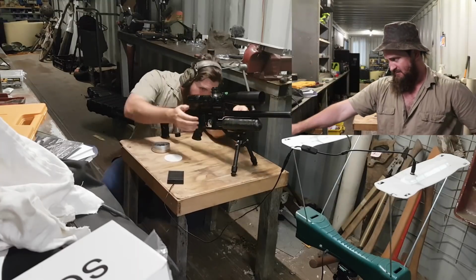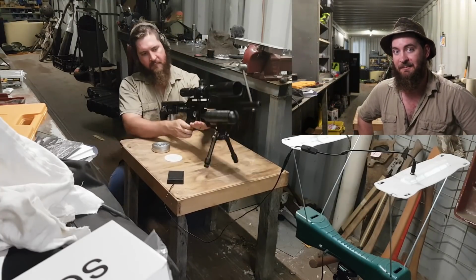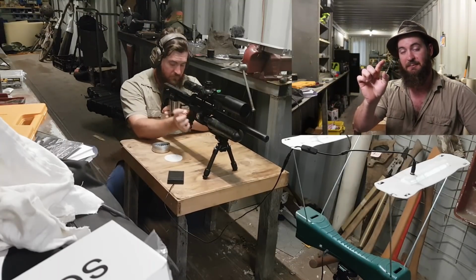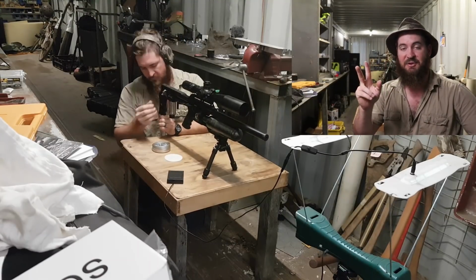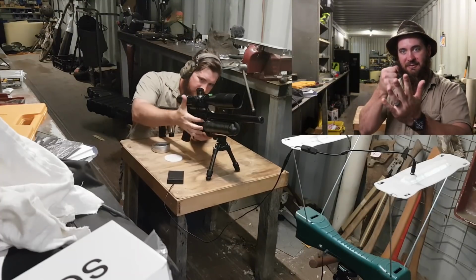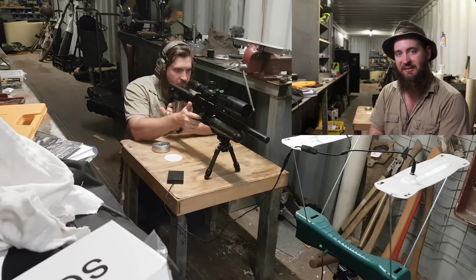It wasn't great with the super light hammer spring tension, so I cranked it up to number 1 instead of minimum, and then I cranked it up again to setting number 2. So I've just added a little bit more boot to it, so it's just a little bit harder hitting into it. It seems like the harder it hits, the more consistent it is.